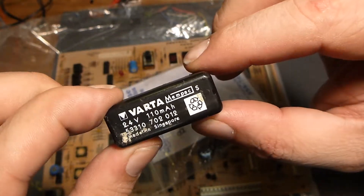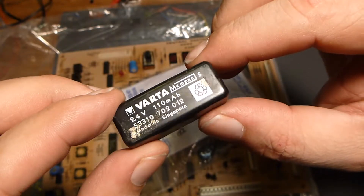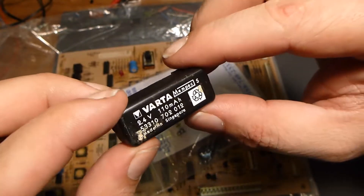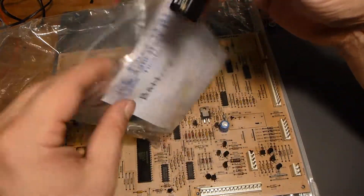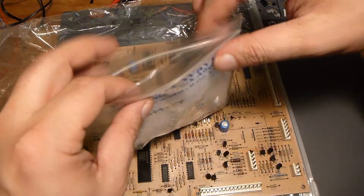There's part of the battery. You can see it's broken open. There's a lot of corrosion in there — looking pretty nasty. Das ist kaputt. It's a 2.4 volt battery with 110 milliamp hours. Basically what he wants me to do is replace this with some nickel metal hydride batteries.